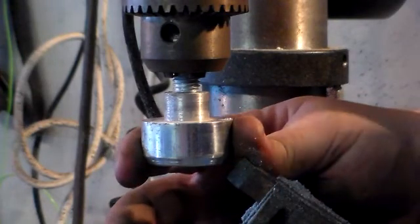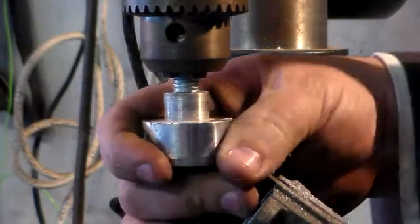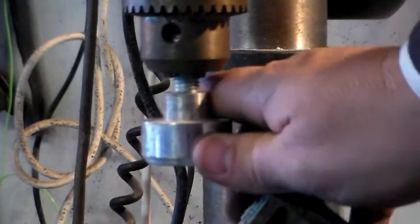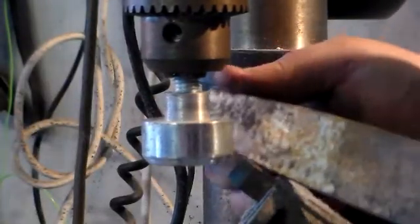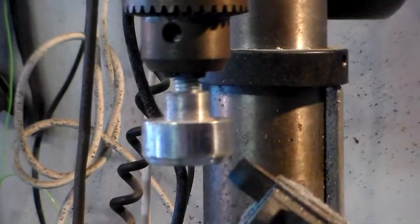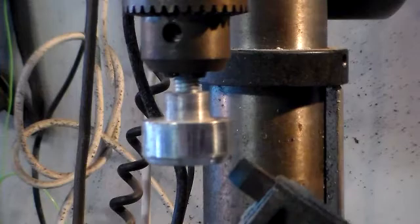What I'm actually trying to do here is form a conical shape — bring this down to a point. Something that would be an easy job if you did have a lathe, but unfortunately I don't have one as yet. So what I initially started doing was mounting it in the drill press and working a rough file against the side to try and bring it down, and it was taking forever — then the idea struck me to try and set up the drill press to use as a lathe.